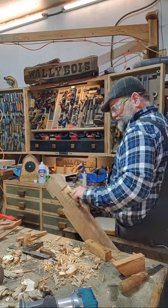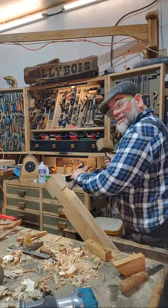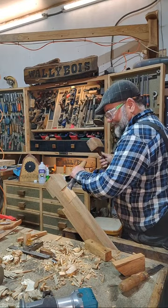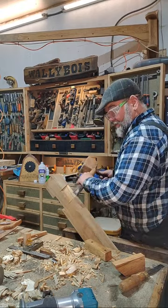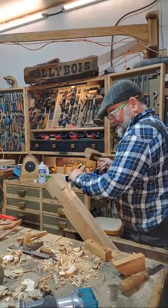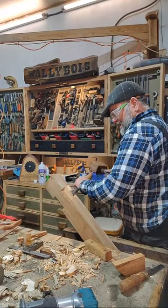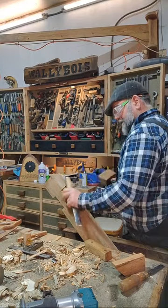That's something we use a mallet for. Let's see, people hit it as hard as I can, you know, and they're falling through. You don't want to fall through, you know, it makes a mess. If you're falling through with your mallet, for one thing, you're effectively going to make that chisel go over there. But you use just short impacts. You don't have to race, do you? You can make mistakes because you've done it like a bull in a china shop. Just allow it to do its thing.